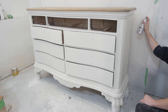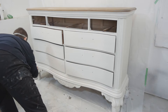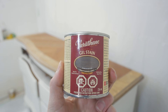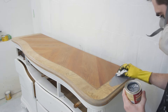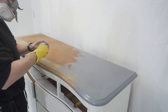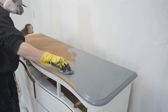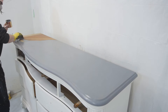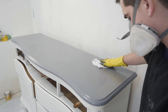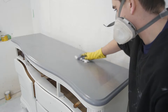After wiping to the look I want, I grab my lacquer and spray a light coat on just so the stain isn't tacky. I decided to try some weathered gray gel stain on the MDF edges, since the Weathered Oak regular stain didn't really penetrate them well and you could still see they were MDF. But honestly it didn't do what I was hoping, so I fixed it up later on — you'll see that in a minute.